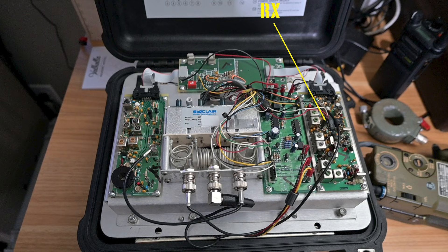It is important to protect our receiver from desensitization, and the duplexer is what accomplishes that. In this device we have a tiny notch-type 4-cavity duplexer. This duplexer is a tuned filter that notches out the transmitter frequency from the receiver side and notches out the receiver frequency from the transmitter side. This allows both devices to share a common antenna — and no, you cannot provide amateur 600-kilohertz separation in a device like this. This device operates on a bit over a 5-megahertz split. If interested in duplexer tuning, I have a how-to video in my content catalog.